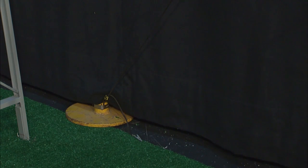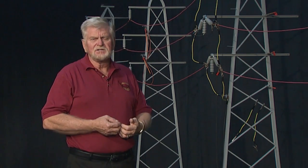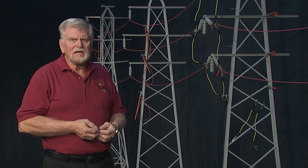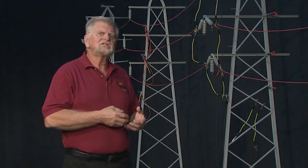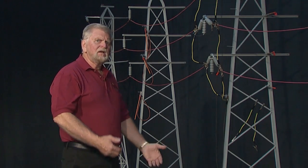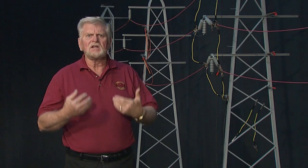To demonstrate this principle, I have set the prop up with an insulated guy wire on structure number three. Normally we would not have an insulated guy wire on a metal structure, but we do have many styles of wood pole structures that have insulated guy wires, and this example would illustrate the hazard on them. An insulated guy wire may have either a fiberglass, porcelain, or wood insert that isolates the metallic guy wire from the structure. The metallic portion of these guy wires are connected to an anchor rod at a remote ground source. If a worker bridged between the conductive portion of these guy wires and either a grounded conductor or the structure itself when an accidental energization occurred, the worker could be exposed to lethal differences in potential.